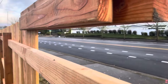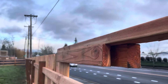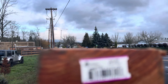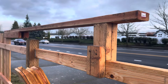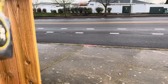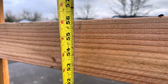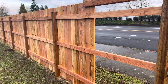This piece is just channeled in and this piece is just keyed in so it doesn't flop around. I just picked a really nice straight two-by-four for the guide. You can get a ten-footer if you want and span the entire bay, which is a great idea — this eight-foot is working pretty good for now. When you get done, you'll be able to look at your frame if you're going to match a gate, and your frame rail if you want to build your frame rails now end up roughly 55 to 56 inches. So you have a really nice gate frame and hinging and mounting points when you put your gate on to match all your rails.